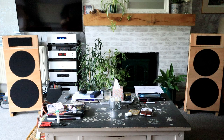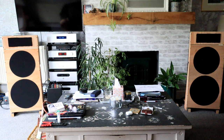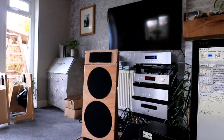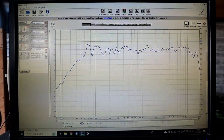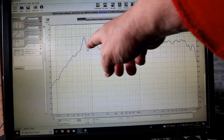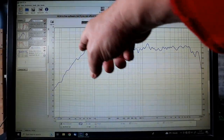I think I may well go ahead and probably will now spend the money on some decent baffles. And of course you can always upgrade the tweeters again with beryllium, which are £400 or £500 a piece. But the PSD from Eminence has probably been listened to by more people across the world than any other manufacturer, so that's why I went for it. There's a footnote — these coaxials over here I've now tweaked and tweaked on Room EQ Wizard, and I've got a pretty flat response at 80 dB right the way across from about 40 Hz. I've got a sub that blends in as well.